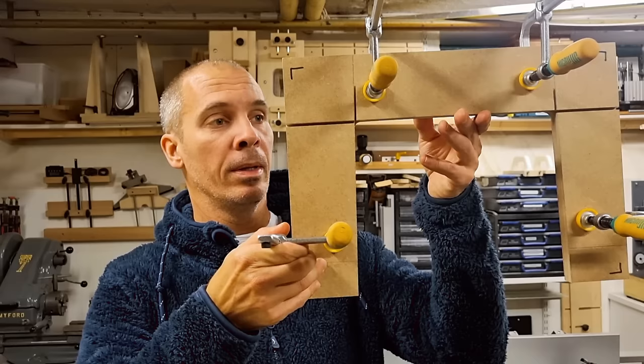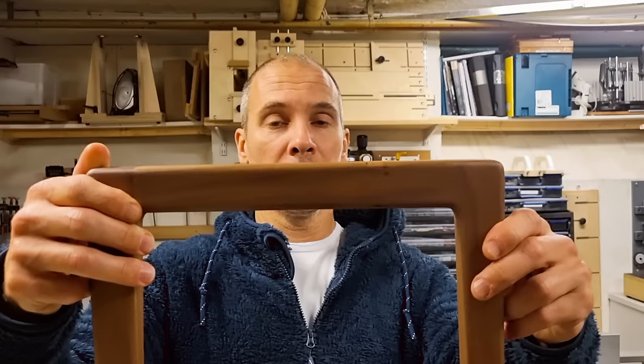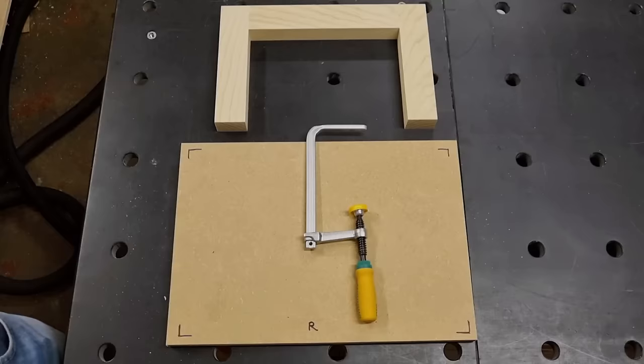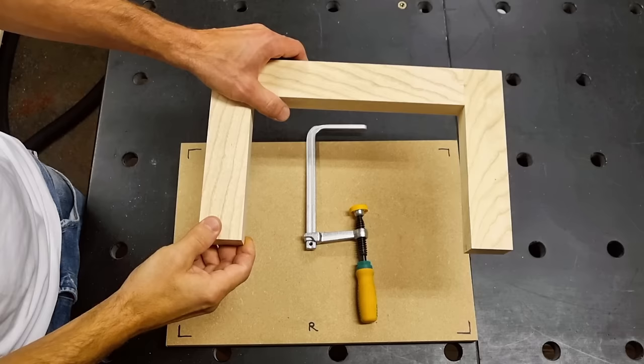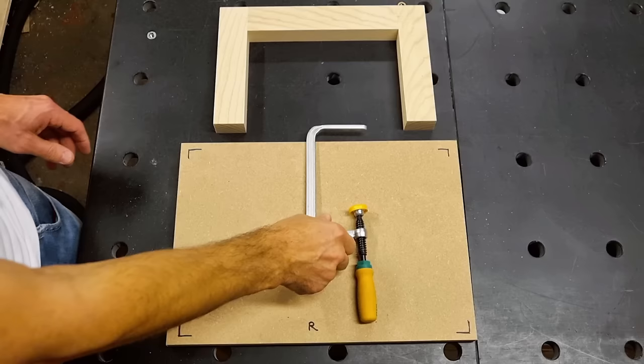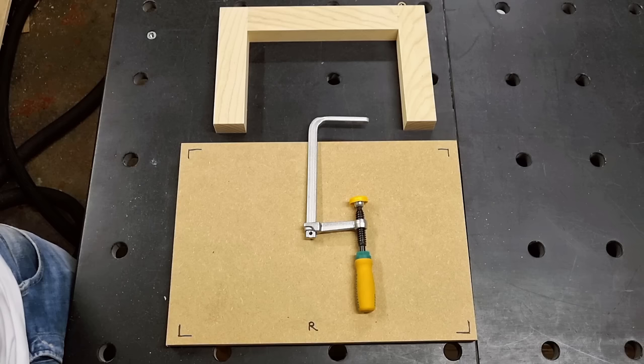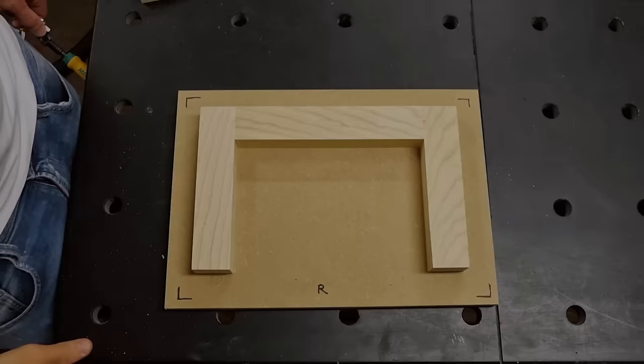It's time for the next template. This is a type I often use for shaping furniture pieces after gluing them together — illustrating a small table or chair base where I'm after a look with tapered sides and a smooth, flowy look with tangent transitions in the corners. I've done some preparation: I made a construction out of ash to illustrate a small table base. The template material is 19mm MDF since I intend to use the clamps from the side. I have a reference edge and squared up all corners.